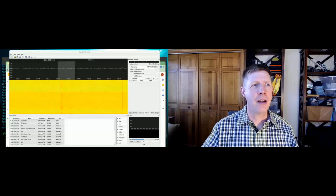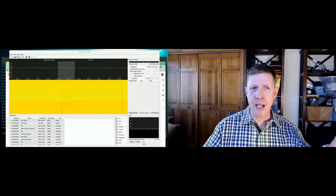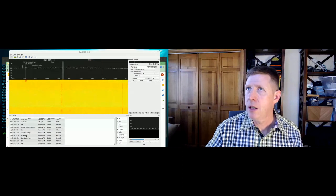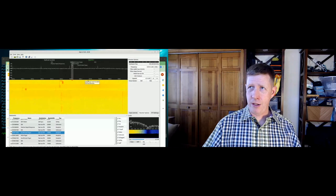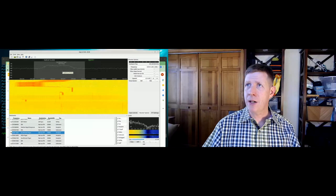One of the things that Mike mentioned is he found a signal and he started sending it. Remember that inside of GQRX, let me show everybody here. I like the screen sharing on this. The other platforms are a lot more difficult to set up and take more time. This is pretty easy. When you set on your frequency, I say, okay, there's a frequency and I want to tune to it. So I set out wide, find my frequency, center on it, zoom in, adjust my center there.